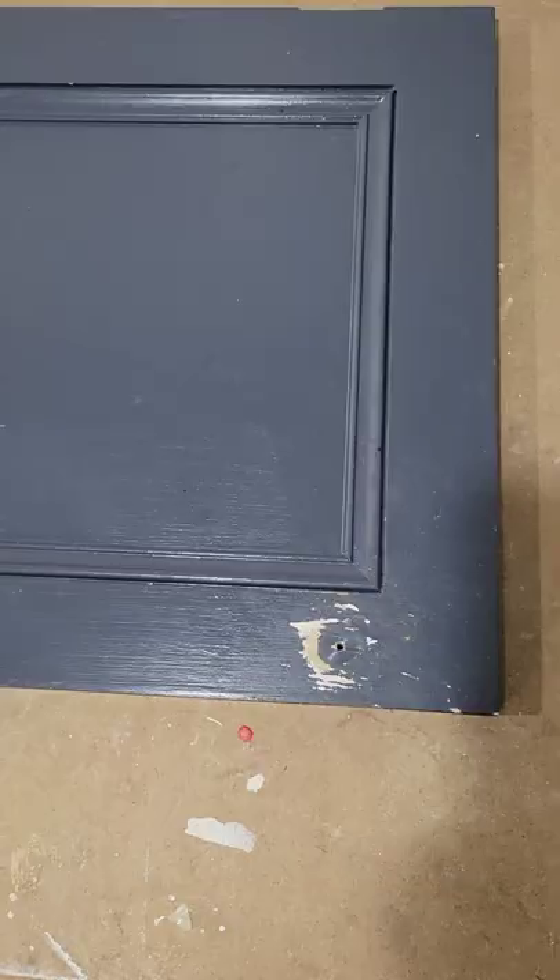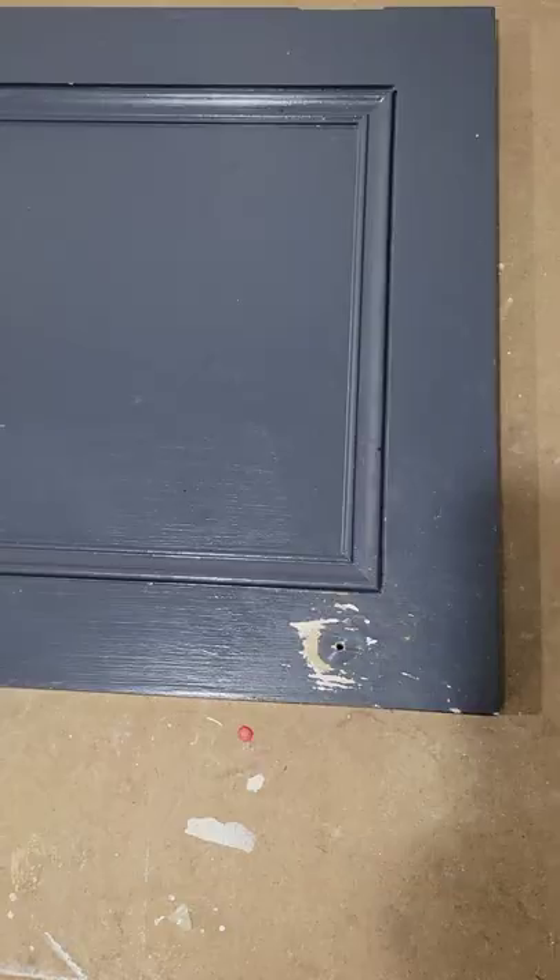So you're going to have to use a different type of paint. To fix this, you'll need to clean it with a degreaser — I like to use these brushes to get it nice and clean — then sand everything smooth, spot prime with an oil-based primer, and go over it with a better paint.